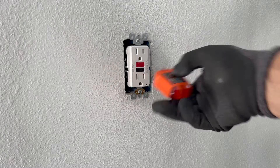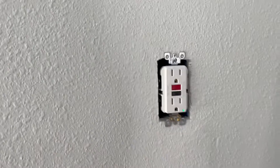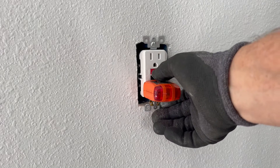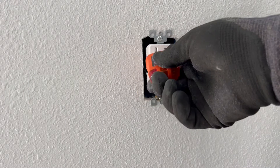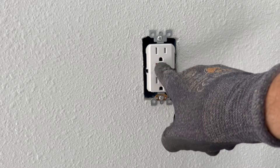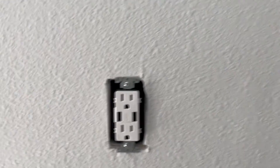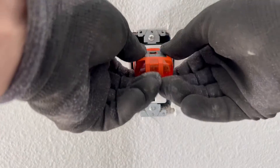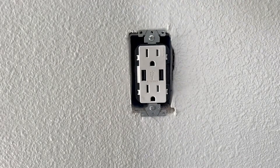Let's go turn the power on. If I did this right — it should come on with no power right now. Push the reset. We got green light — that's good. Always check it later with a plug checker — another awesome Klein tool. It trips when I put it in and hit the button, two orange lights — that's what you want. There's a test trip button here. So the GFI is wired right — we know because it trips when I push the test trip. Outlet next to it, this new fancy pants with the USB — two orange lights, we're wired good. Does it trip the GFI upstream? Yes it does. So that is wired correctly.